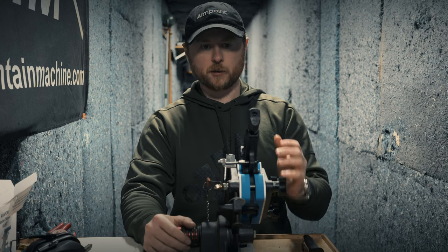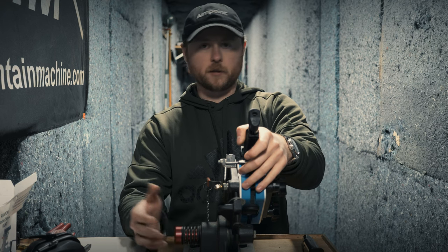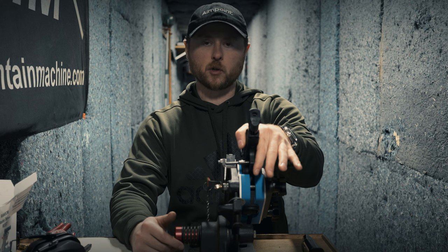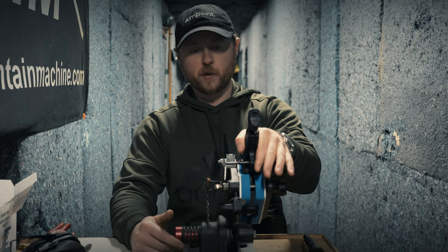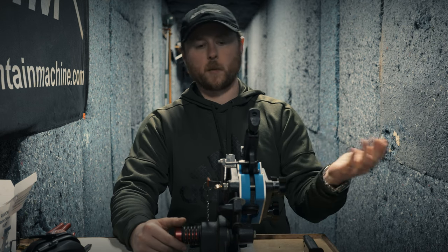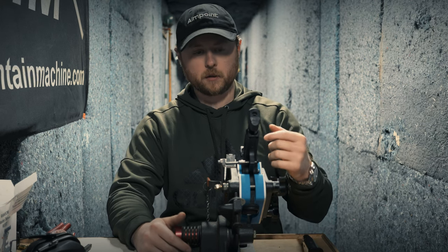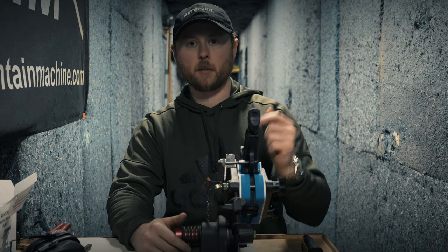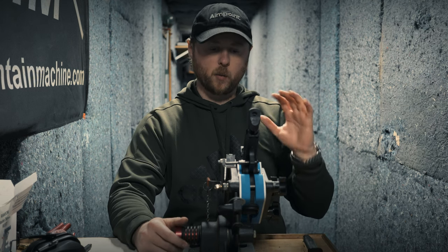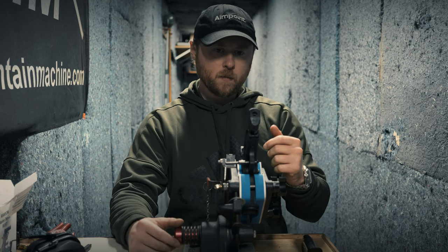What that does is allows us to shoot a 10 round. We typically go with 10 round just because different guns have different size mags. We keep it consistent. 10 round control group, and we do two groups for everything. So we'll get the muzzle climb on a factory gun, and then we can do the same thing, test it, same ammo, same day, typically in the next 5 minutes, with the compensator installed. We use this a lot for testing for production to figure out where we want the performance to be and what each pistol can handle for reduction.